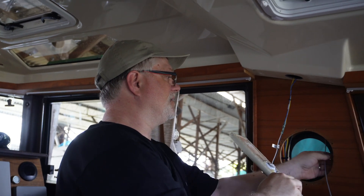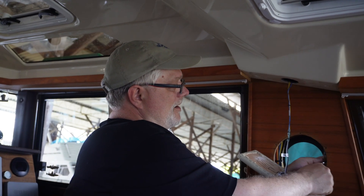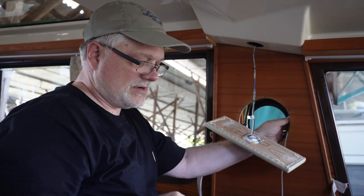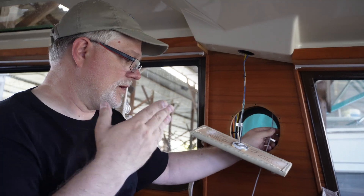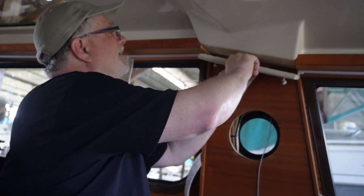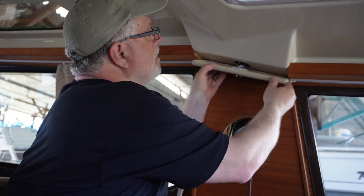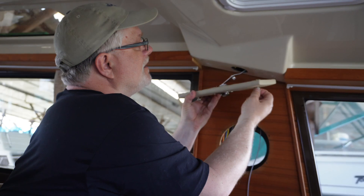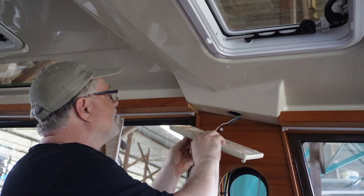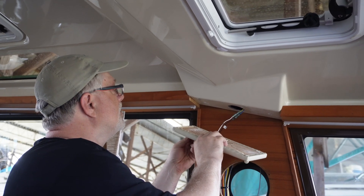One of the things you want to do is — there's a cable bundle right here, it goes right behind this. You want to zip tie this cable to that bundle, because otherwise it'll fall out and sit in your window. This is always tricky to get in there; it's kind of pressed between this and that, and it's got two screws. You want to line the same screws with the same holes they came out of.